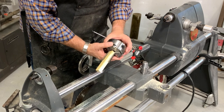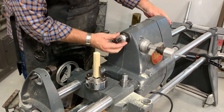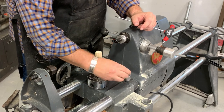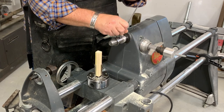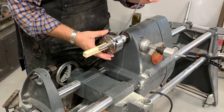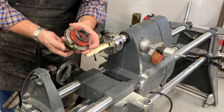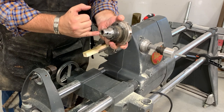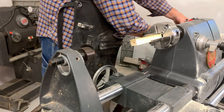Let's set this up to drill some holes. If you're using a chuck, some chucks are designed to connect with the unthreaded 5/8-inch shank on the Mark 5, but many are not. Many will have a thread designed to fit a Craftsman chuck, for example. You can purchase an adapter with a 5/8-inch female that locks onto the end of the Shopsmith spindle, adapting it to accept whatever thread your chuck uses. Many manufacturers will also make chucks pre-bored for the 5/8-inch spindle.